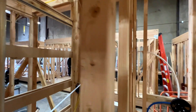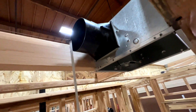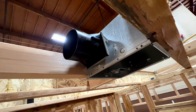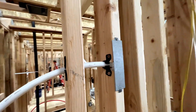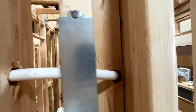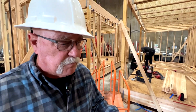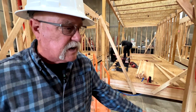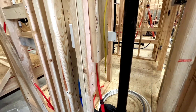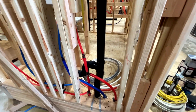The dryer vent is going to go up through the top plate and then up through the roof. Tomorrow they'll also have to vent their exhaust fan out through the roof. We had to get the pipe from the shower valve through the wall and up to the shower head — we notched the wall and put a nail plate over it so we can't put a screw or nail into the pipe. Overall they've done a great job. Tomorrow they're going to start putting siding on the outside. We decided on this build not to side the outside until all plumbing and electrical was in, and it made it easier for the students.